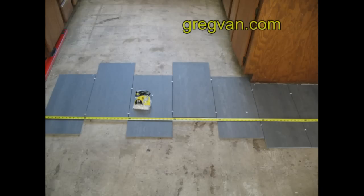Here's something I wanted to share with everyone. Before I ever break out the adhesive thinset and actually attach the tiles to a floor, I take the tiles out of the box, a few of them, and lay them out on the ground. I take some measurements and try to figure out which way is going to work the best — where I will have the fewest cuts and the least amount of waste. I just wanted to show you guys and give you an idea of some of the things I do before I ever lay any of the tiles.